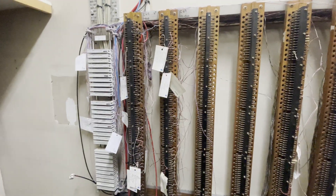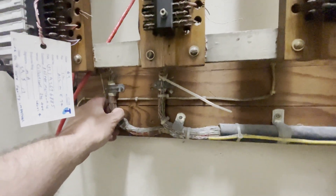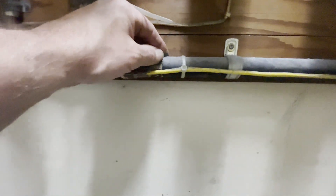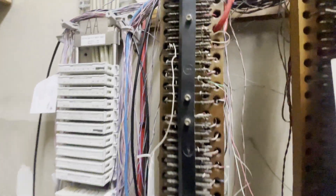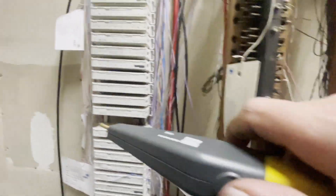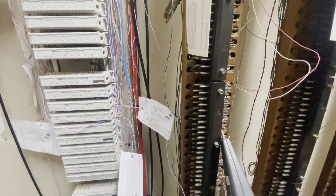I've got my toner, I'll go through and find it. You can see the old cable that came in here — I guess a hundred-pair — with the two splitting off for the A-side of the frame. And then here you've got all the individual cables going up to each of the floors for the IDFs. These were always a dream to work on because you can just run straight down and find the tone so quick.